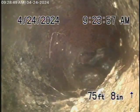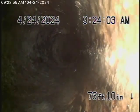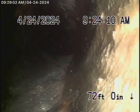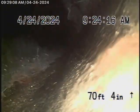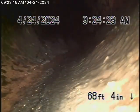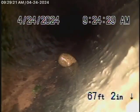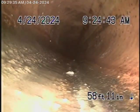It looks like there's a cured-in-place pipe lining over here. I'm not sure — I'll just have to look at this real quick, because it could be a very thin lining. I think they're definitely lining that over here. This all looks okay in my opinion, but right at the end there it's definitely very badly dislocated. Yeah, this is definitely a cured-in-place pipe lining.